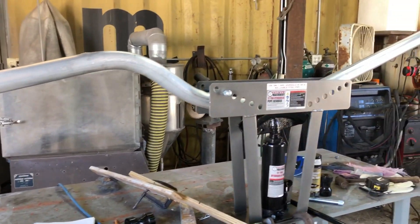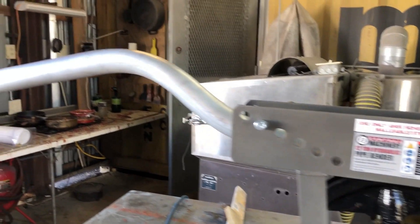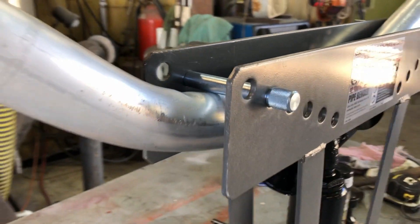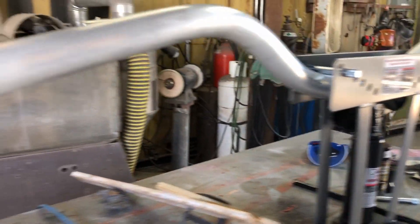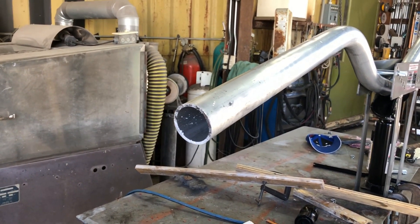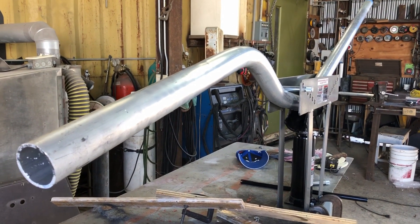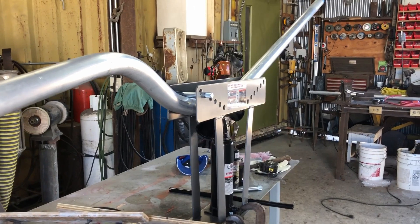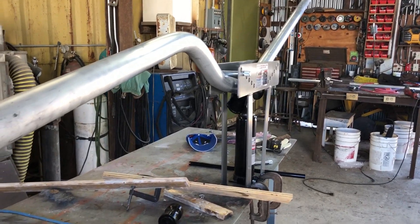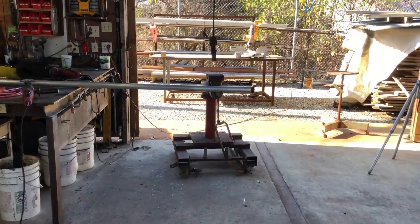I purchased two-inch pipe and before I even started I realized it was too big. The radius of the bends were so long they were overlapping and causing it to kink because I couldn't fit it in the bender correctly. I screwed up one piece of pipe, went back and swapped the others. I'm going to do it with inch-and-a-half pipe now. This is pipe, not tubing, so it's inch-and-a-half on the inside and almost two inches on the outside. I learned from messing with the two-inch pipe that I really need to grind these edges off.